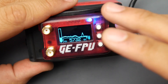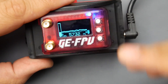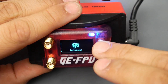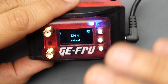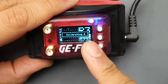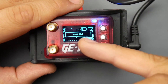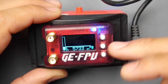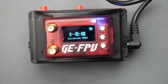The one thing I really don't like about this module is the calibration sequence. There is nothing telling you how to calibrate it — no documentation that I could find. It was a pain to get done. Once you receive yours it'll ask you to calibrate, and it's actually counterintuitive. The calibration just says 'calibrating' and counts down. Usually it tells you to turn off your VTX and then turn it back on — we're going to get a 'failed' here because I don't have anything on. The default values it gives you are incorrect, so you definitely want to calibrate to take full advantage of its performance.